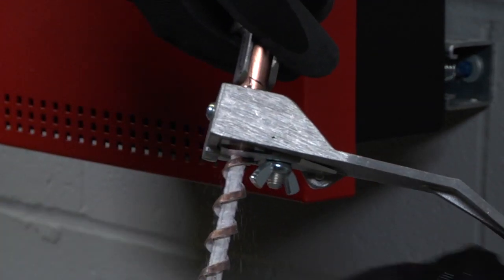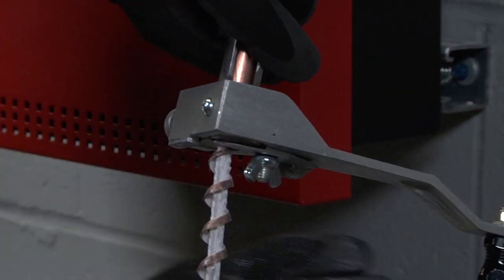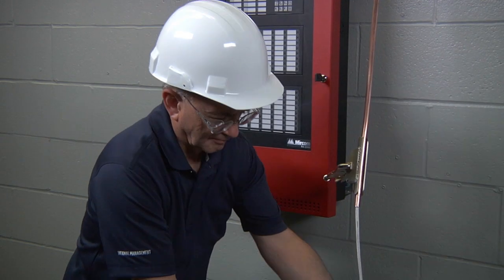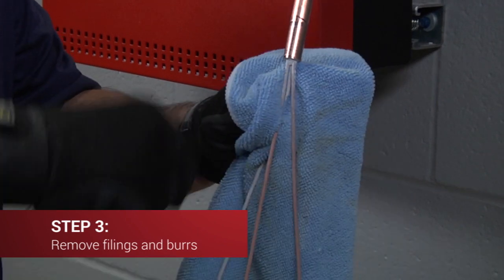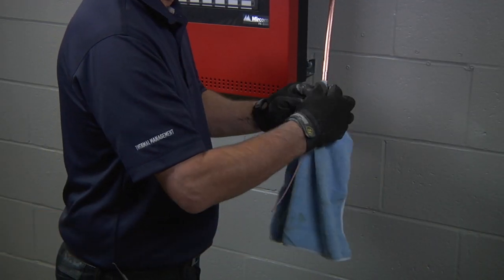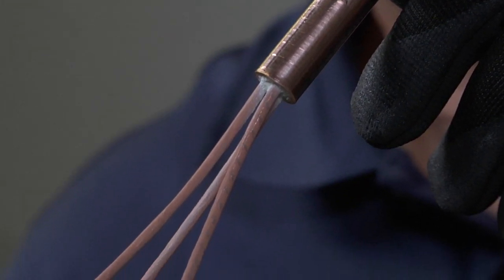For final stripping, grip the cable with the hand vise at the second mark, and when the stripping tool touches the edge it will stop and make a clean cut on the cable sheath at the first mark, thus exposing the correct length of solid conductors. Straighten the conductors and ensure that they are evenly spaced. Wipe clean all of the surfaces, including the conductors, to remove loose powder and visually inspect the magnesium oxide insulation at the face of the cable for traces of copper filings and burrs.